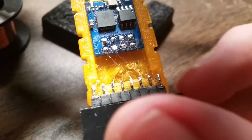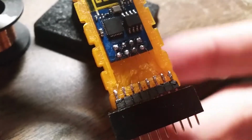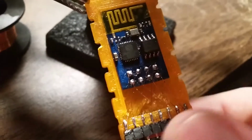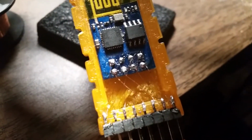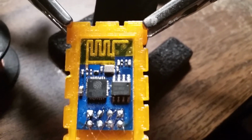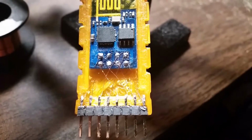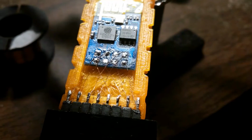And in this segment here, I'm just showing the fine wires that I soldered in to go between the original 8-pin header that came out of the bottom that I removed, down to the 8-pin header that was inline. Once I got those tiny little hair type wires soldered in, it was good to go. They're specifically for jumping, and they're really easy to use. Your soldering iron burns the enamel right off them. You get two little spools, as you can see on the left there, for about $1. Anyhow, I got that done.